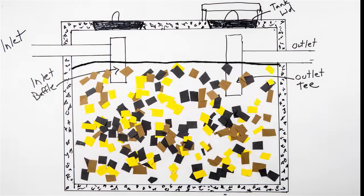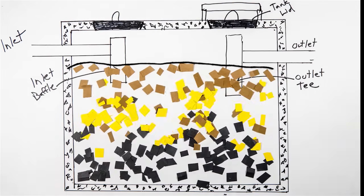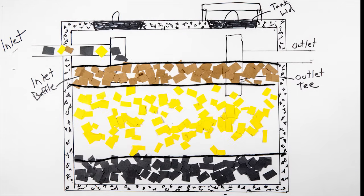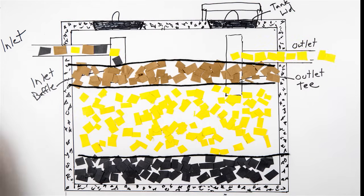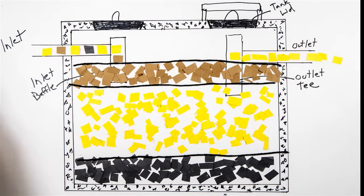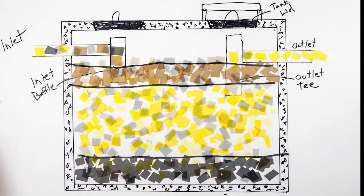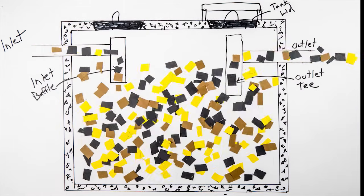The job of the septic tank is to separate the wastewater into 3 separate layers, trapping the solids and greases inside the tank and only allowing the liquid effluent to leave the tank. This settling is done through both biological activities and retention. If your tank doesn't settle out into these 3 layers, there's something not right and your tank is not working as it should. Let's look at the layers.